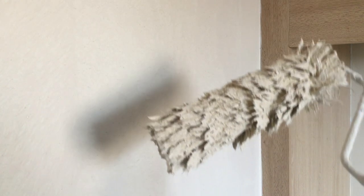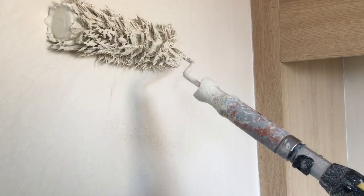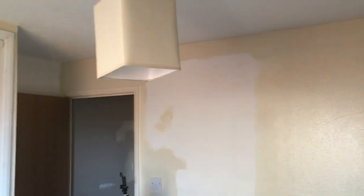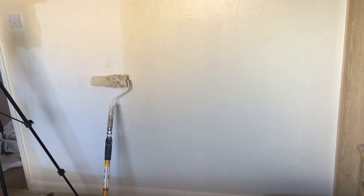The foam rollers that you see a lot of people using are quite dry - they're up there scrubbing away left, right, up and down. With the sheepskin, just make sure it's loaded with paint and go very slow, back and forth. This whole wall will be done within two minutes. Just to show you the coverage with the sheepskin roller - this whole area here has been done with one dip in the scuttle. Two dips and the whole wall will be done.